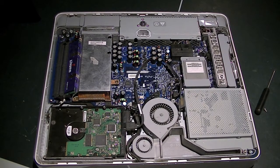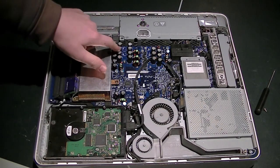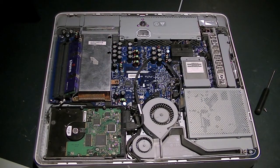So here's the computer. There were a few things wrong with it. These two capacitors right here, and there were a few over here as well, were bulged and bursting. So I took this entire thing apart, unsoldered those capacitors, and got some new ones.